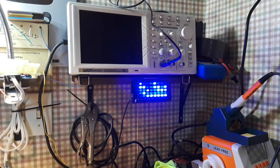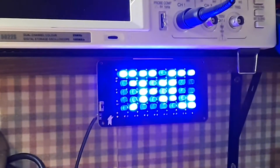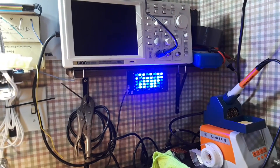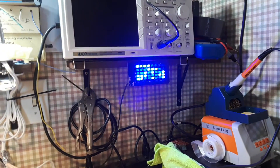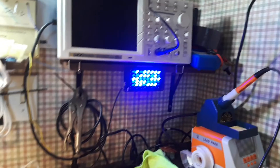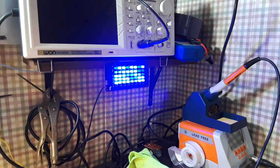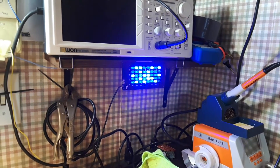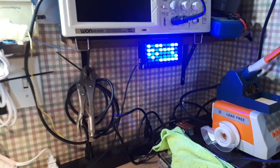Hey, what's happening guys. I'm sure you remember this little device here underneath the oscilloscope — I call it the supercomputer. It's basically a homage to the same thing that Big Clive shows in all of his live streams. These are simply 1.5 Hz self-flashing 5mm LEDs. They require only resistors to limit current and no other support circuitry. What's cool about them is when you first turn them on they all come together, then instantly they start drifting and you end up with a really beautiful pseudo-random pattern — reminds me of the computers of the 1960s that you'd see on old television shows.